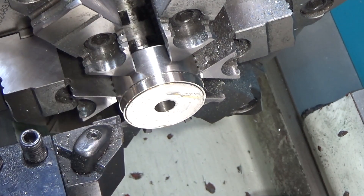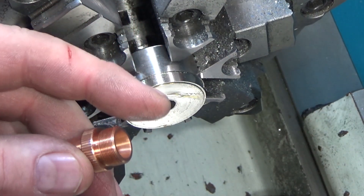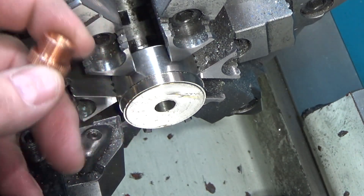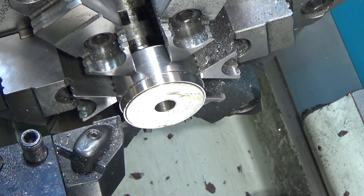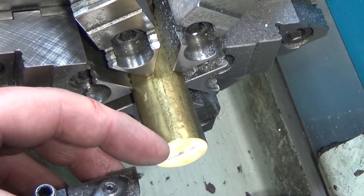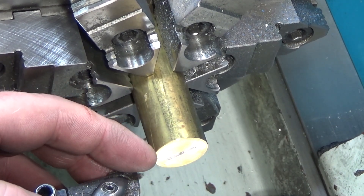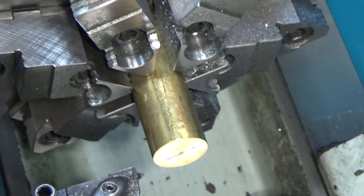First step: I've got a stainless blank and I need to make a way to test these threads, so I've got to do the female first. I actually have to make two parts just to get the one. Making this out of brass wouldn't be a bad idea just because it'd be so easy to do rather than a hard material like stainless. I only have to test one set of threads, so maybe we'll switch materials. All right, we switched to brass because it's going to be much easier to work with - this is to test the threads. Since I'm threading copper, it's more likely to get damaged anyway.